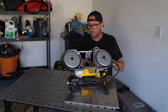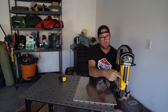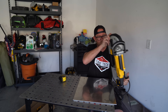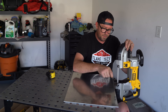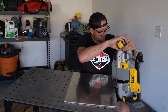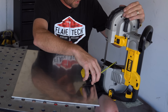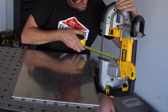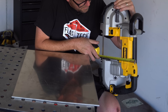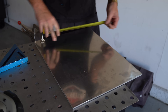First thing I want to do is get a few measurements. Since it's going to be mounted off to the side, I need to find out how much I need to cut out for the motor section to fit — notch this side of the plate out. I also want this blade to be right in the center, so we've got to cut a little slot out there so we can slide the blade in, then get our mounting holes. Looks like we need to cut about two inches out of the top, and since this is 20 inches long, 10 will be the center — so we need to cut about five inches out of the top.